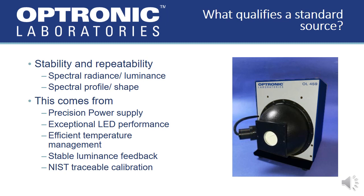The OL-459 can be calibrated for luminance, chromaticity, and spectral radiance over the range of 400 nanometers to 1000 nanometers. The customer defines the desired luminance, chromaticity, and/or spectral radiance range to meet their needs. A maximum of 10 profiles can be saved to the device, each representing a potential calibration setting where these options can be requested, measured, and reported.